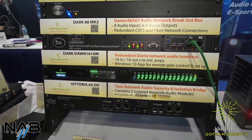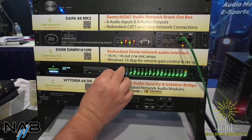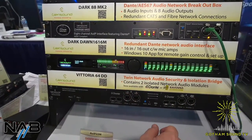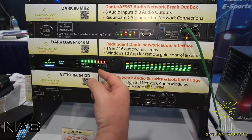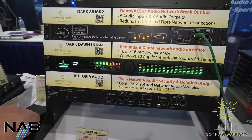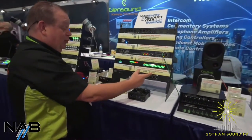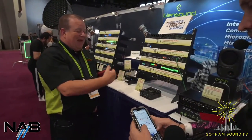It has four-segment level metering for all 16 input channels — a coarse meter, but you can see if anyone's clipping. You can adjust the level from the front panel. There's a screen and a selection knob: pick your channel, adjust the gain, and it switches to a high-res meter in the middle for live adjustments. There's a headphone socket — tap the headphone button to control volume and monitor whatever channel you have selected. A small section shows sample rate, which power supply you're on, and which network.